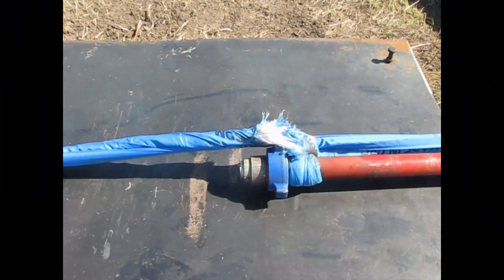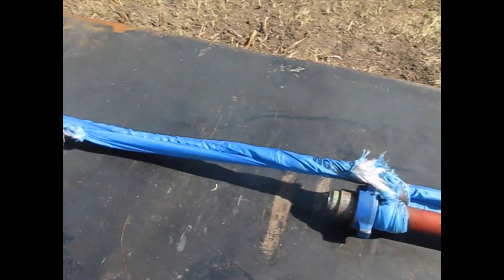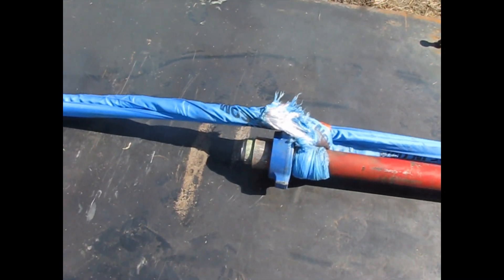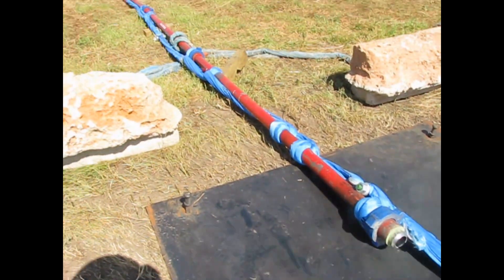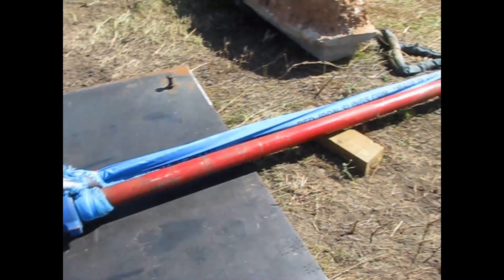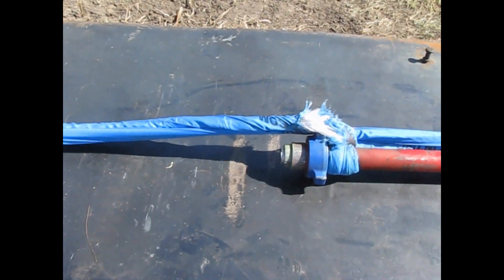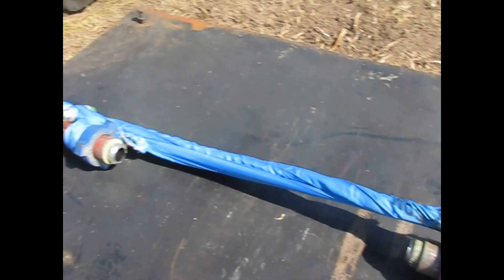One of the things I really like about this system with the half hitch is that when we tested the rib and spine, during every test the hammer unions pulled out of that rib, and what that does is allow the other ribs to slide along the spine, giving you a much longer area to control that energy and a lot more side-to-side movement. Whereas with the red iron sling installed in the choker configuration, most of the energy is dispersed between just these two points.